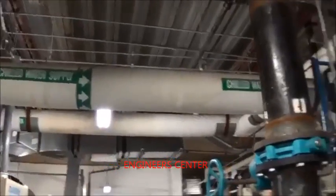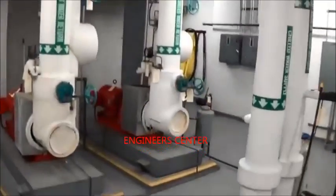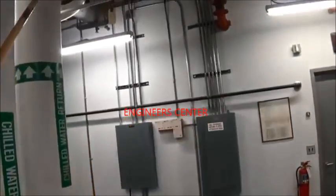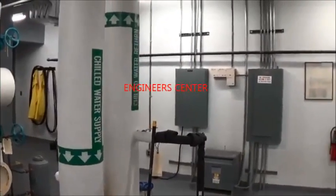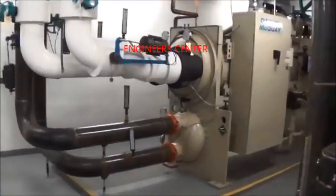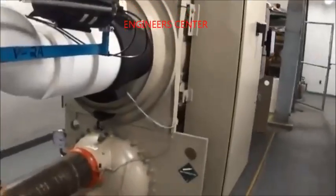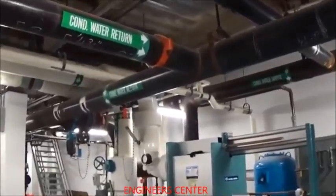We make cold water with the compressors and the refrigerant. You can see the chilled water pipes — they come across the top of the chiller plant and go to a series of pumps. These pumps pump the chilled water up and down through the building to a series of air handler coils staged throughout the facility. A fan behind each coil blows cool air into distribution boxes in the office space. As the heat is picked up in the loop and comes back to the chiller, the heat is put into the condensing side and rejected out through a system called a cooling tower.